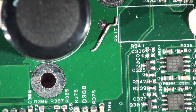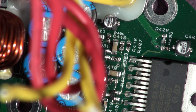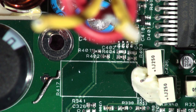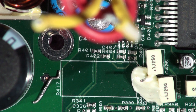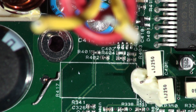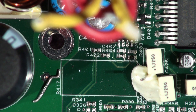You can see over here this little resistor has burnt out as well. There are going to be a number of components blown by the fact that this board doesn't like having one of the supply rails missing — once a supply rail is gone it goes into a weird lock-up mode and things start popping all over the place. Anyway, I hope you find the resistor issue interesting if you're an engineer working on these. We're doing JBL and Bose and all sorts of repairs all the time — subscribe, there's a link at the bottom right of the screen.